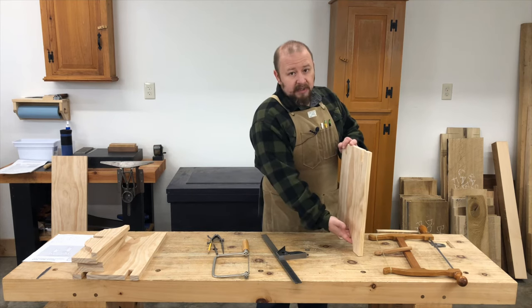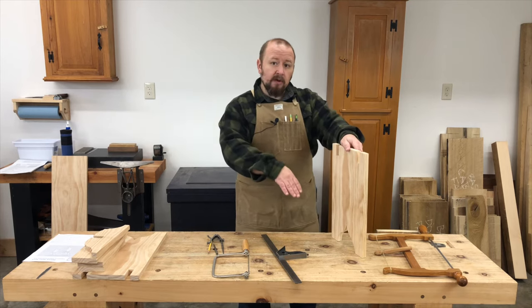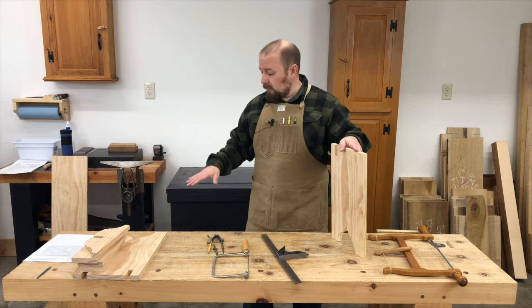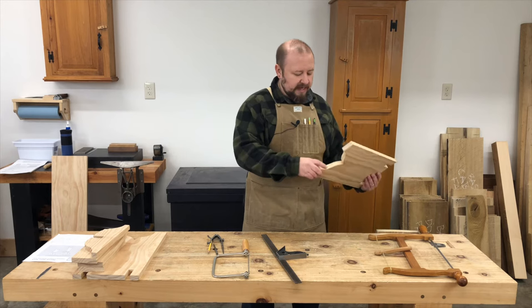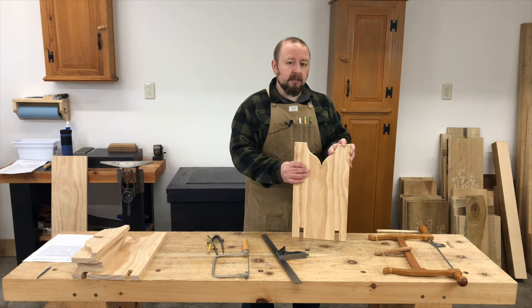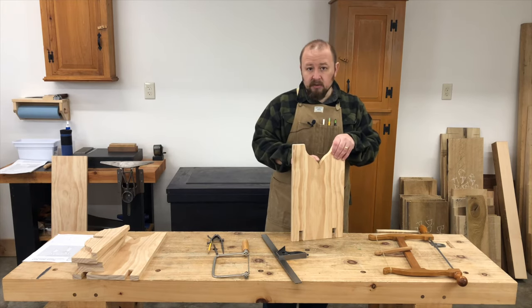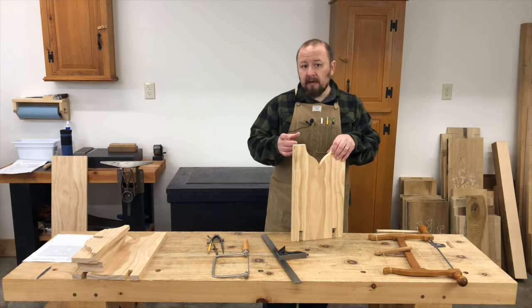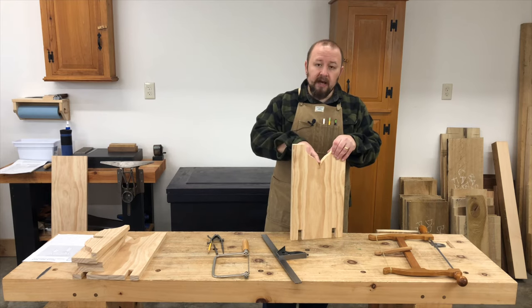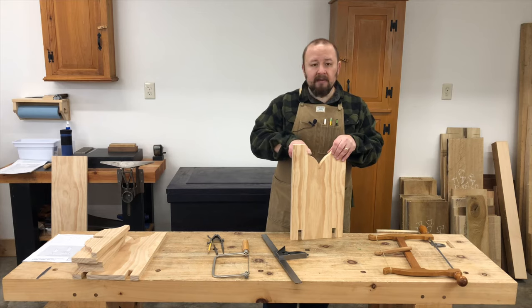It's on the bottom of the piece. It sits close to the floor. And when viewed from a typical angle above, you'll never see this cut surface. If you really want to clean this cut edge up, you can use some 80 or 120 grit sandpaper wrapped around a flat stick for the convex areas, or wrapped around a dowel for the concave areas.